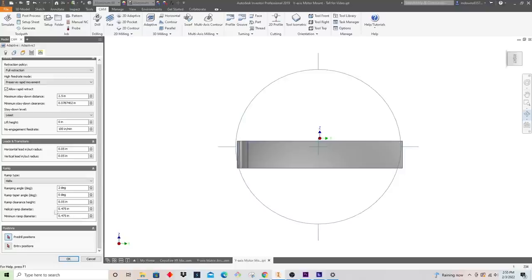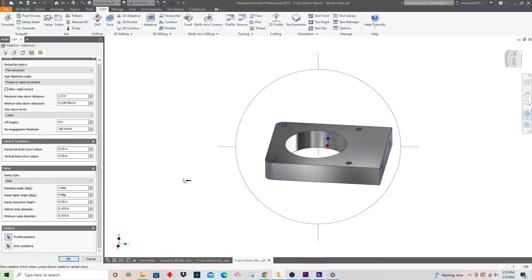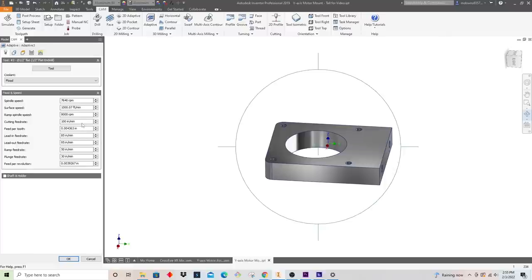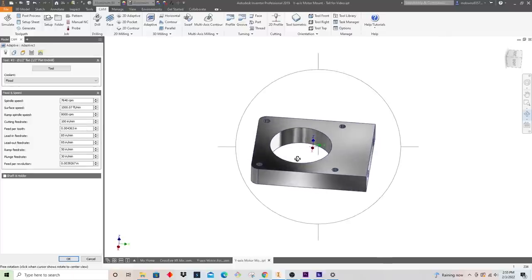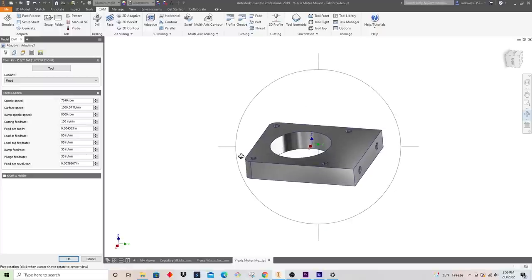And the helical ramp diameter usually defaults to something a little bit under the tool size. I like to go as big of a diameter as you can. It really allows for the most chip clearing as it's making its way in. Now what we need to determine is, to define a cut, you need three things to understand if it's really going to work on this machine. You need your feed rate, your cut depth, and your amount of radial cut in, or width of cut.